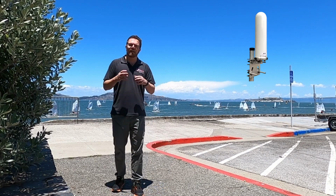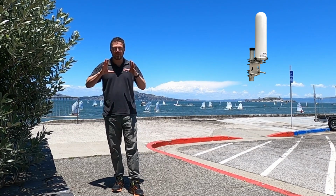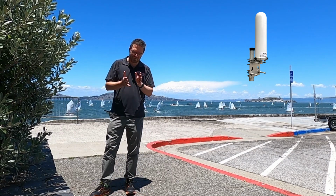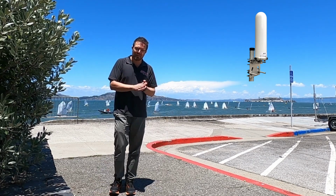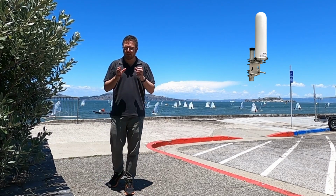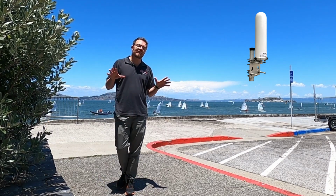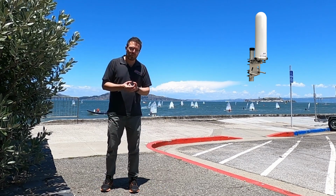That antenna, the AOA M4G, the Alpha Marine Omni basically, is just a simple, classic, good antenna. It works from 650 megahertz, so well below the 4G band for Australia, and it actually works really well up to 4.5 gigahertz. So it really covers everything beautifully through the whole 5G band in Australia as well, which is what we want to do.